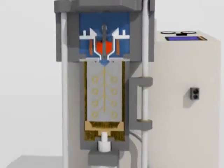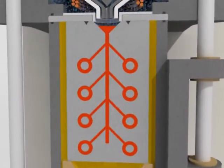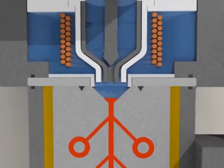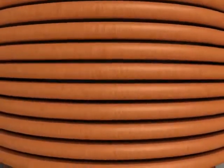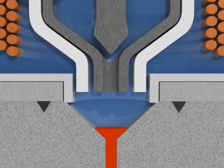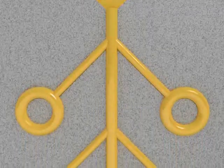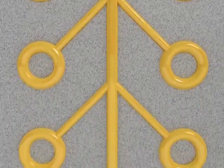The metal, once completely poured into the flask, is pressurized by argon up to 4 bars. This pressure, being applied to the molten metal, forces it into the mould while the vacuum pulls it. This results in a very smooth surface due to the effect of the vacuum and a dense, well-compacted casting due to the overpressure, which benefits both thick and thin sections.